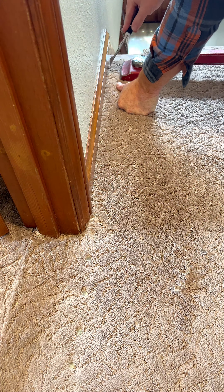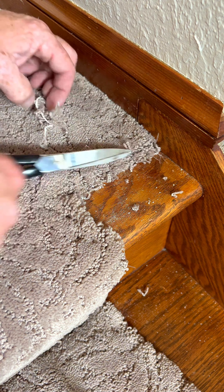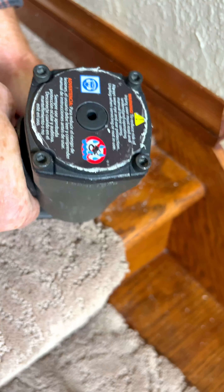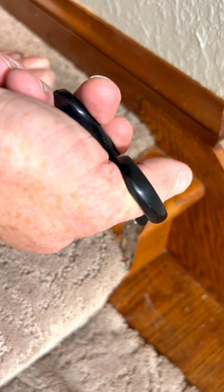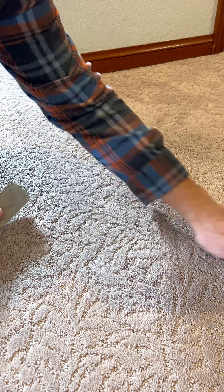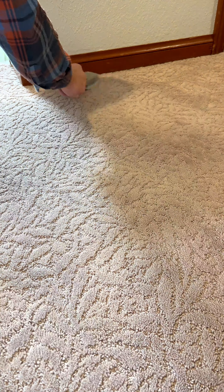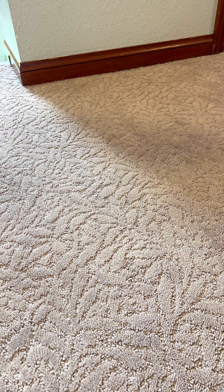I stretch back with the walls lifted up, trimming extra carpet as necessary, and tucking back under the baseboard. A little upholstery work around the step to make things look fresh, followed by some rubbing and brushing around the crease of the old ripple. Because even after stretching tight, you can still see where it used to be, so this helps it to blend in.